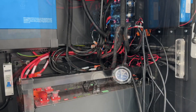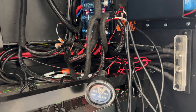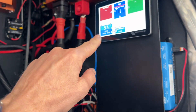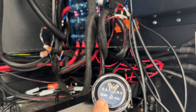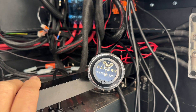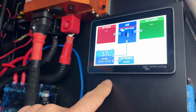Let's start up. So we just started up here at idle and we've got our touch display showing the temperature of the alternators. Up here we've shown the power going in — 339 watts — and you can see it down here. The Victron display shows you the net number; this shows you the actual number. We've now just moved to a high idle and that shows you what's going into the batteries — we're now up to 3800 watts.